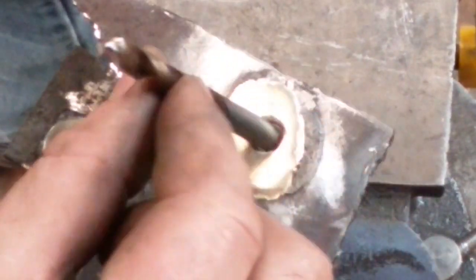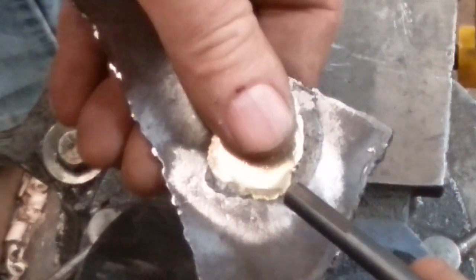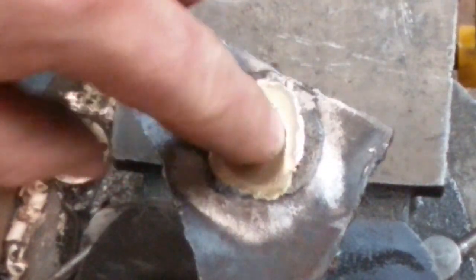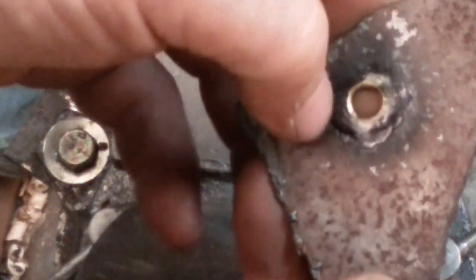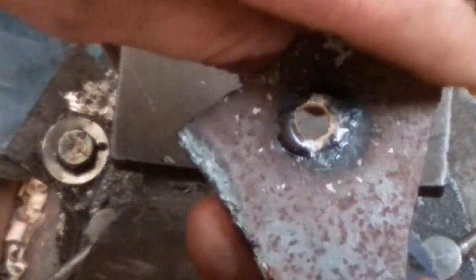By the way, I drilled this hole 11/32" to start with. After brazing, a 9/32" drill bit just barely goes in there, so we lost a 16th of an inch of diameter. Always drill your holes a little oversized before you braze — that gives you a good layer of brass all the way around in the hole so you don't get rust starting down in there that expands and pushes your connection apart. On the back side you can see quite a bit of slag ran through — in a real application I'd take precautions to clean that off.